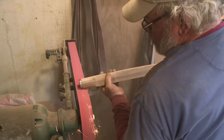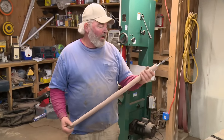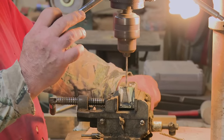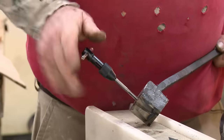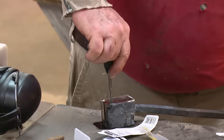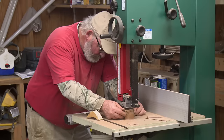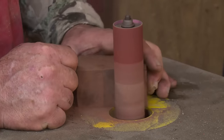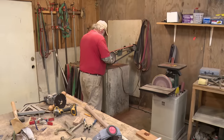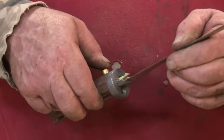Last day. First thing I have to do is finish the cane. It's a little wobbly and rough, but I think it gives it character — we're going to sand it down really smooth and then oil it. This is my Damascus billet for the pommel. That's carbon steel, so carbon steel doesn't like this. The Damascus pommel has to be tapped so it'll screw on the bolt that I've welded into the tang of the sword. If I break the tap off in here, that's it. I wish I had another tap. Sure enough, it breaks. Failure's not an option, so I'm going to go to my plan B, which is building one out of a piece of rosewood. It bums me out because the rosewood pommel isn't as pretty as the Damascus one, but I'm just going to have to settle with the rosewood. It's going to be a good weapon. Button's working. It'll definitely hurt somebody, and if you got a bad leg, it'll hold you up.